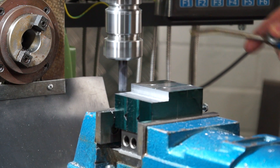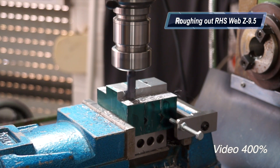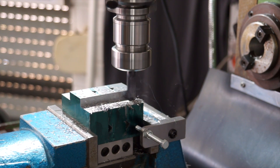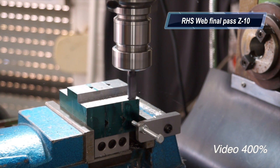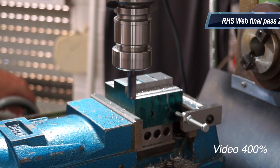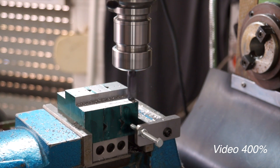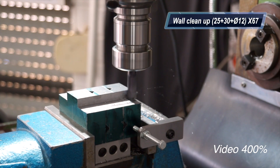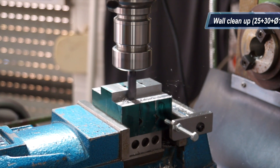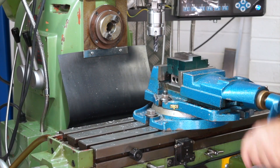Right hand side web now — we'll rough that out as well, going down to negative 9.5 in Z. A little bit of a brush here and then in we go again. Here are our final passes — just taking that half a mil to clean up the floor. I'll drop in with the brush to clean it; just be careful of the spindle when you do that. Cleaning up the wall — I'm at X67 because I've gone 25 for the first web, 30 for the middle, plus the width for the diameter of the cutter, and that gave me that figure. They're all done and they're all the same.